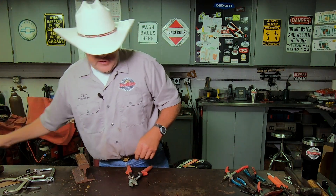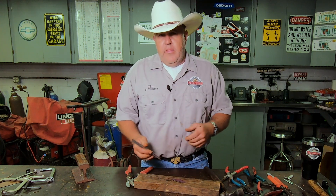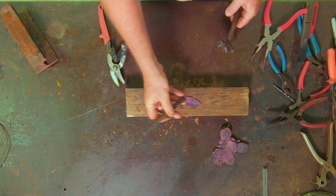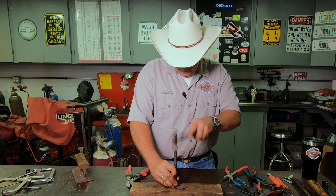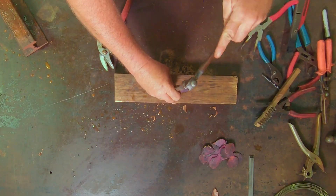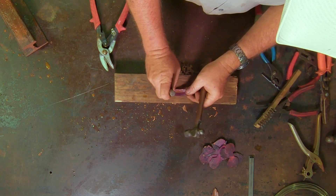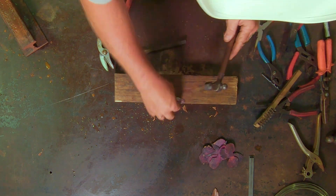Let's throw in some artsy work here. We've got a soft piece of material and this is what we're going to use to work in some of our design work. I've got a cold chisel. The name of the game here is control of what you're doing. I'm going for the baby hammer — we don't need a big hammer here — and we're just going to put the vein right down the center of this leaf. Now it has a stem in it and we'll put the individual veins in. We don't want them to be too obvious, hence the baby hammer, and we're doing it into a semi-soft material so we actually do leave an impression in the copper. This will be more obvious once we take a brush and brush off the scale.